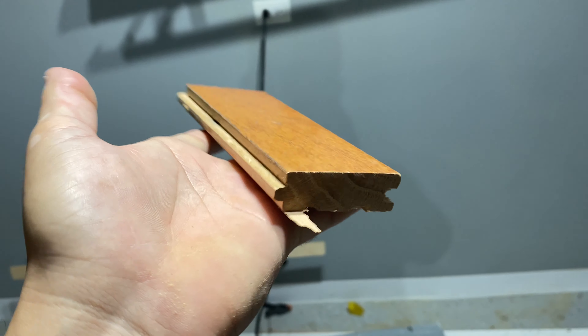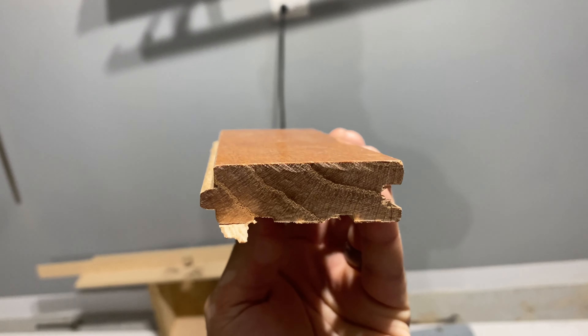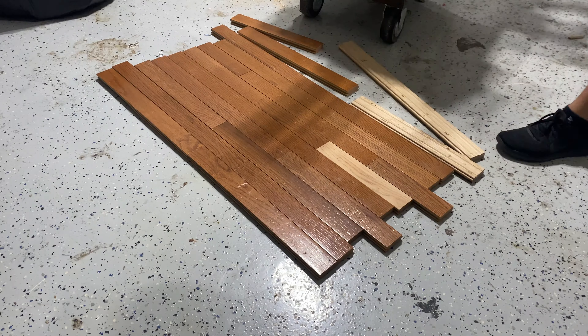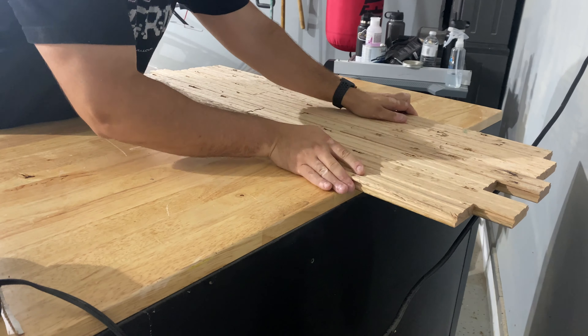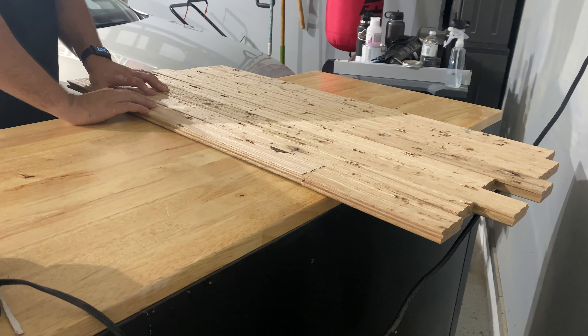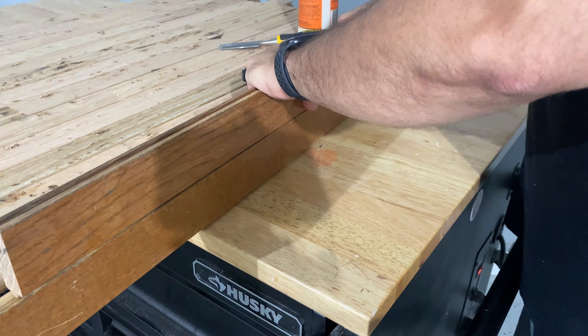Since this is wood flooring, there's a groove on each side of the wooden boards, and this is what's going to make it easier to align everything perfectly. I started piecing together my boards using this system and I made sure the layout was at least 33 inches in both width and height. Right now we're setting up the foundation for what's going to be the bottom of the tabletop. Once I had a nice layout, I transferred it over to another flat surface upside down.